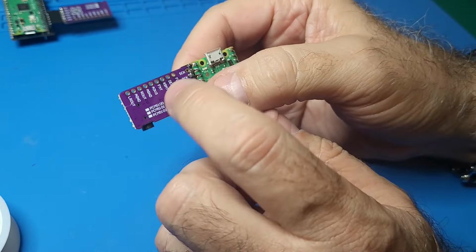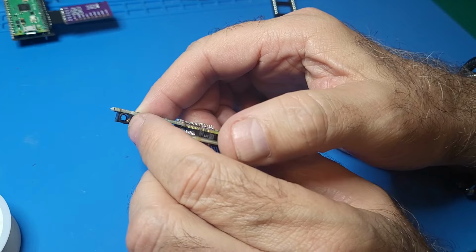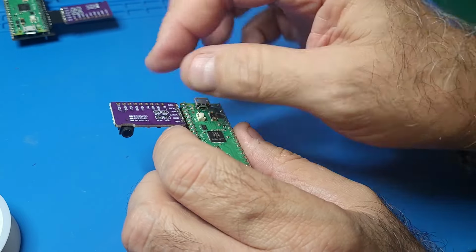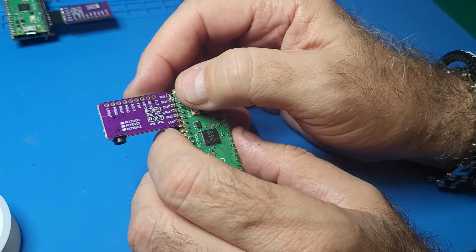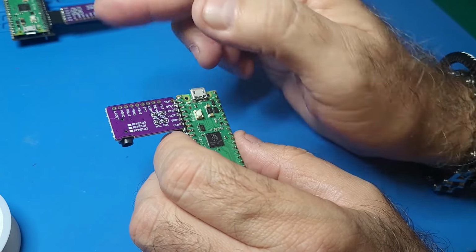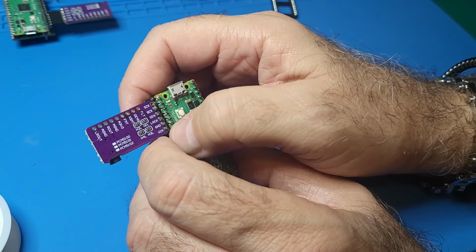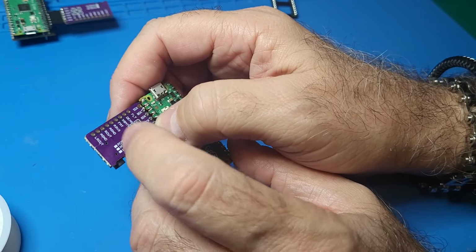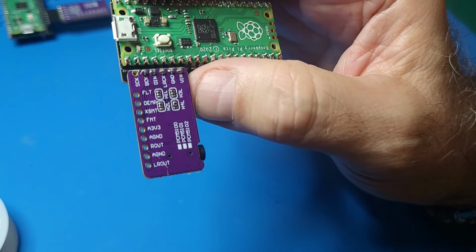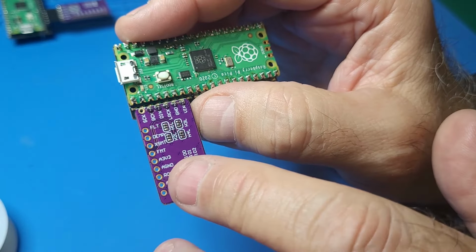And then here, we can actually do one of several things. You can solder leads onto here and to a plug in the back of your computer, or you can put a stereo plug in here and take the wires from the plug here without having to solder anything and send it to a plug on the computer. You can also take the wiring here and go to pin 7 on the 8-pin DIN in the back. Pin 7 is pretty much used as the second sound channel. You have your right and your left. So you can even set that pin up and you can see here what everything is laid out for you. Okay, let's see here. So you have your left out, your ground, your right out, your ground, and so on.